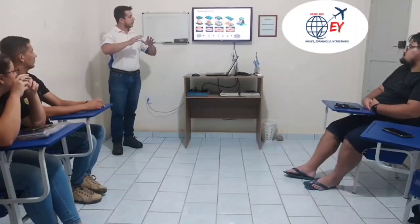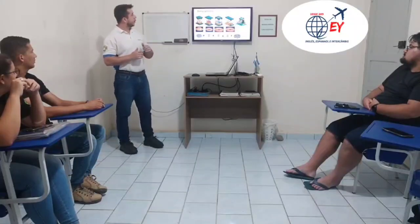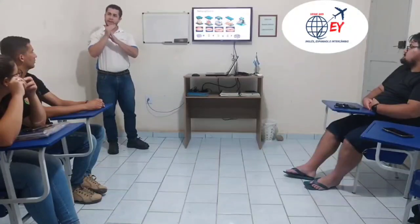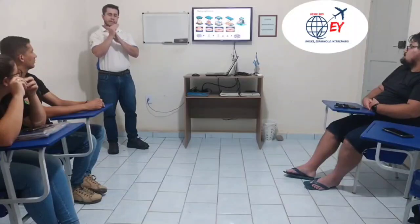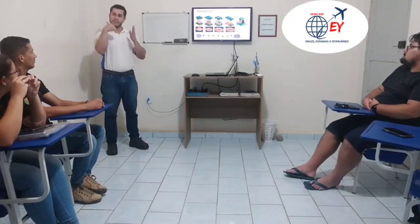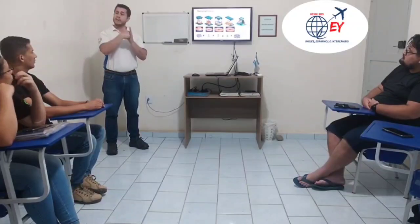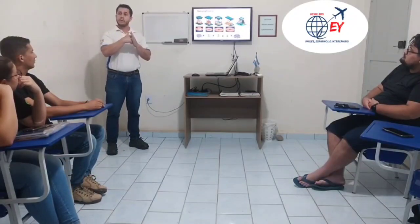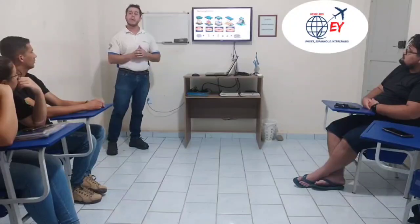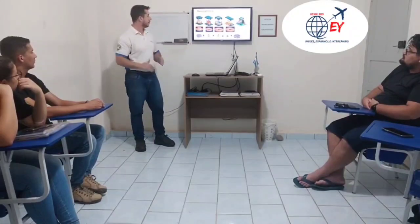Many profiles of the disc. Operation 3 is the flange periphery. In the flange periphery, you deflect the disc. Deflecting the disc is very important in the process because in this area you assemble the ring, and in the assembly line you weld the ring to the drop well. Because this is the flap. Okay, the flap is this.